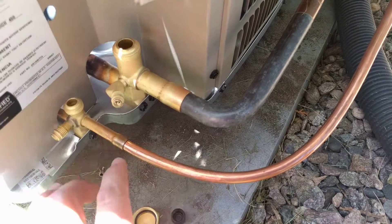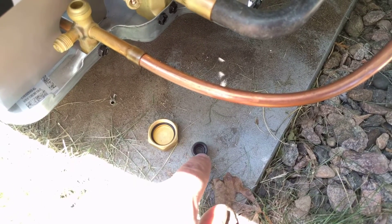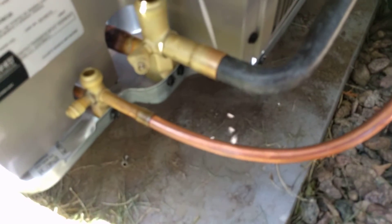I've already removed the caps off of here, here, and here, because they do have rubber in this cap — a gasket — and this one is made of plastic altogether. So take those off so that they don't overheat during brazing.